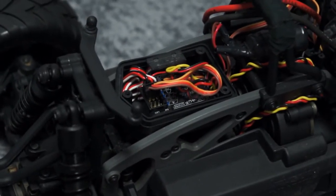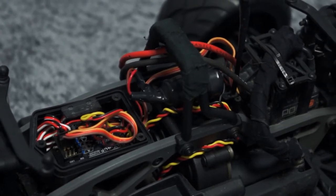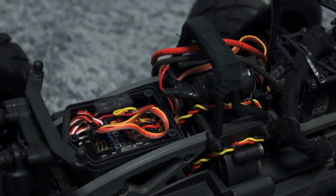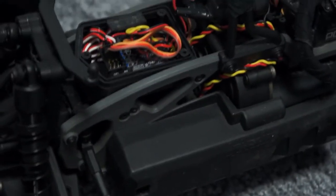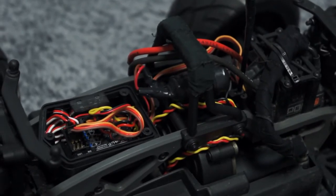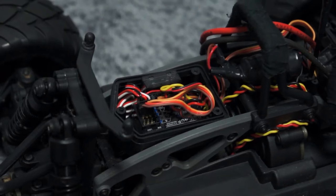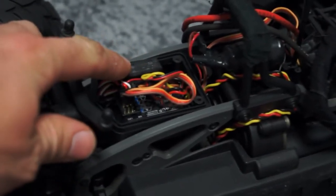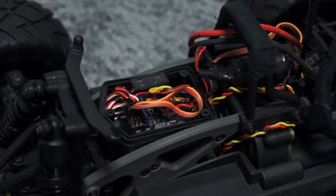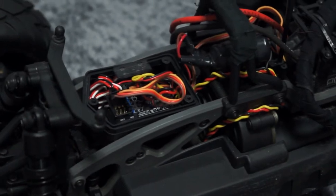So what that thing does, it basically compensates for fluctuation in the input voltage. So those momentary things when the servo is drawing too much current to turn the wheels, the capacitor is actually compensating for the momentary load, and that is sufficient for the gyro not to reboot. And everything works quite well now in terms of the control of the wheels, so steering works well.